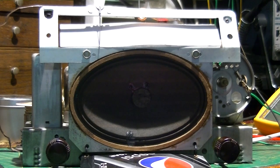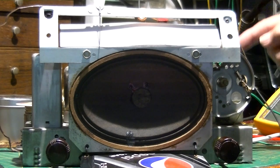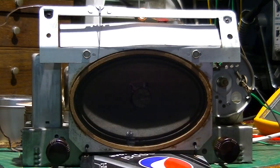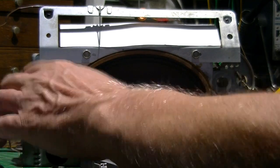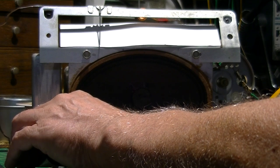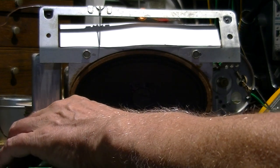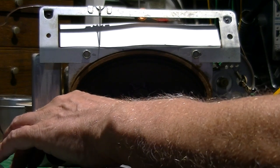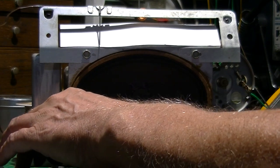It's ready to go back in the cabinet. I just need to tweak the antenna screw a little bit to get it right on the money. It just goes to show you - you just keep prevailing and you can get them. I mean with AA5s - if there's something really bad like an IF coil or an oscillator coil, then perhaps you'd have to scrap it.